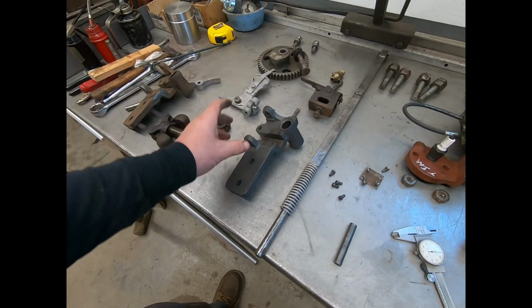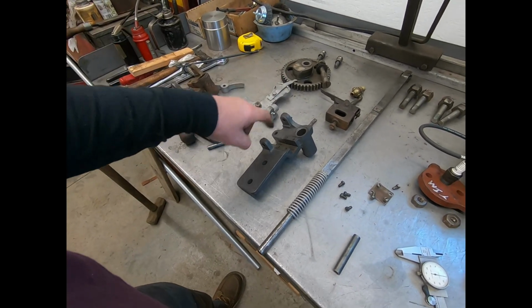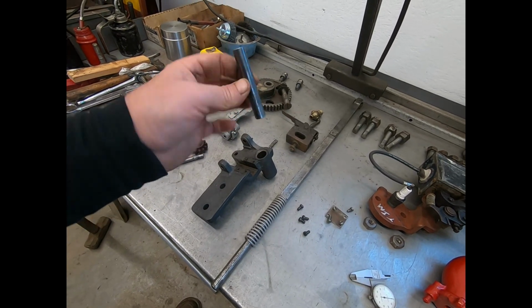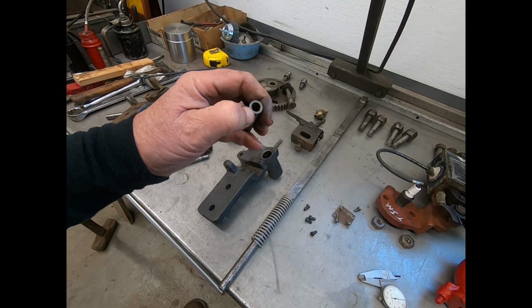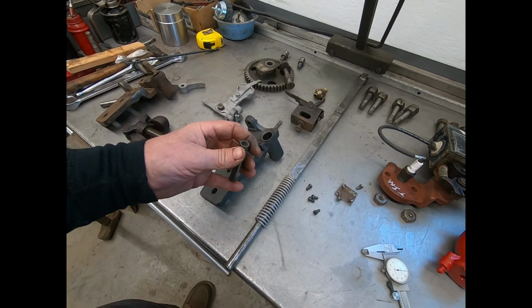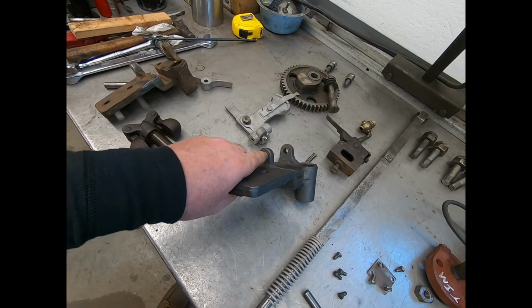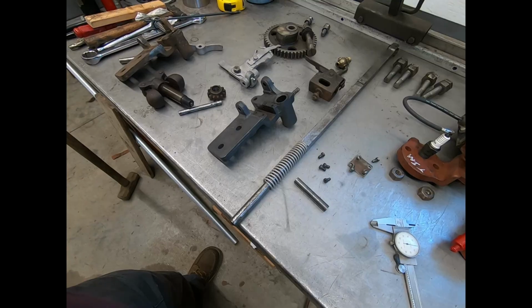So that's no problem. I'm going to clamp it in a vise on the milling machine. I'm going to drill down through the both of them. I'm going to put this, it's actually for a 5/16 valve. So that means when I get done, I'll have a very, very thin piece of cast iron in there, but that's what I want. And I'm going to bush that. If you put a thicker piece of cast iron in it, you end up coming out in the meat a lot more and it weakens it. So I just want a thin piece in there, just enough to tighten that back up.